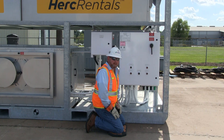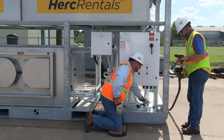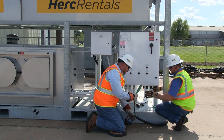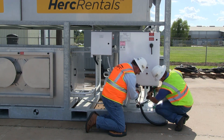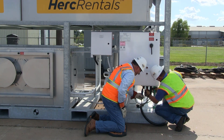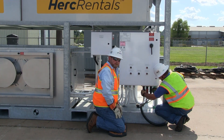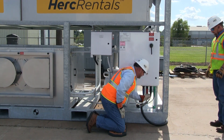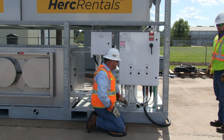The next step is connecting our main power lead. We'll start by removing the weather dust caps off L1, L2, and L3 as we bring in the power leads. Please note the first power to hook up is always the ground, followed by L1, L2, and L3. We're running 460-volt, 3-phase — we've verified the required ampacity. We currently have our power source locked out and tagged out. Now that we've made our connection, we're going to check that all cables are tight, with no nicks or frays, and that cable routing doesn't present any trip hazard.